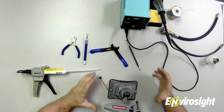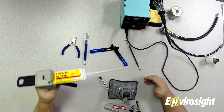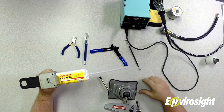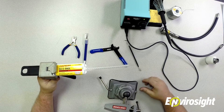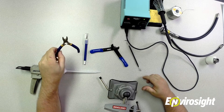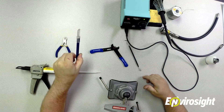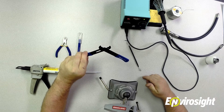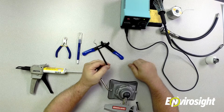For doing a Rover X re-termination, we need a few basic hand tools. First, make sure you have your epoxy for doing the termination. We use a Loctite brand, part number 00CL — basically a five-minute, two-ton carrying strength epoxy. Anything equivalent to that would work. You need a basic pair of wire cutters to cut the wire back to the proper length. You'll need an exacto blade to strip back the jacketing on the cable, and a pair of wire strippers to strip the jacketing on the wires so you can solder them into the cups. I also like to use a dental pick to help separate the Kevlar — it makes it a little easier.